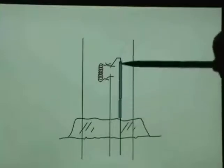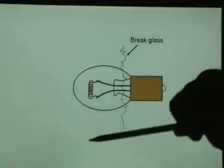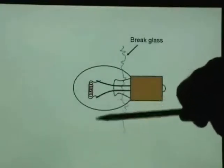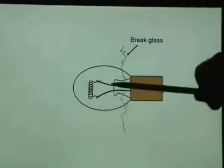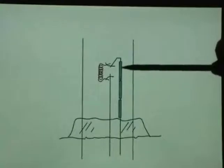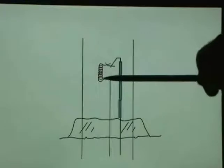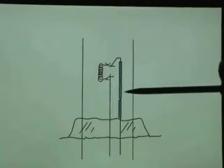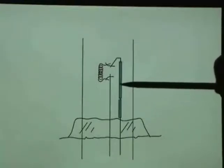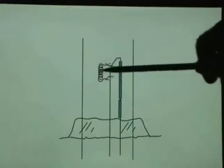Here's my so-called glass press I'll make out of a test tube base and four wires. What I'm going to do is spot weld one iron wire there and one iron wire there before I cut these two, because then I'll have some support and things won't get out of alignment or maybe even break the filament. I'll put maybe three or four glass spacers on this wire because these two wires and the filament are going to be inside the grid assembly.